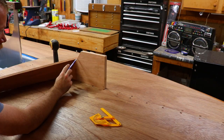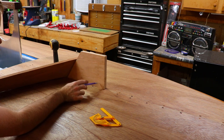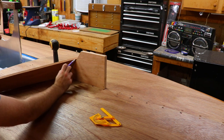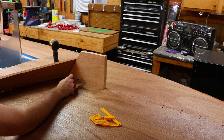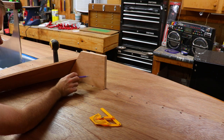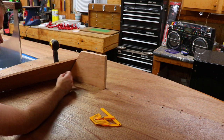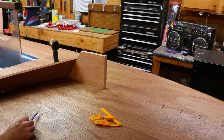The book 'How to Build a Wooden Snipe' has it as kind of a trapezoidal shape where it has a flat top and then angles down to the front of the boat like so. I feel like that's kind of big and clunky, so what I think I'm going to do is have some sort of an arc where I can put in a fastener down in the deck and a fastener here. Then I'll blend the top in somewhat with the rub rails - that way it's a lot less material, a little more sleek, and I can even streamline it so it breaks the waves and doesn't send water up over the top of the splash guards.